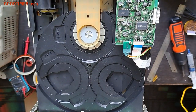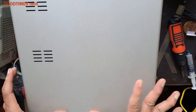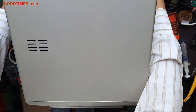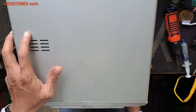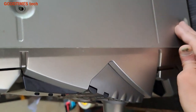The top cover, sit in this way here, first insert it on the front side, here, then pull it backwards, and here there are grooves on the side, just insert them. Here you see there are grooves, this should enter in this way here. Okay, now we'll fix the screws,